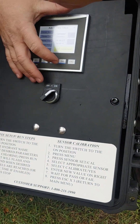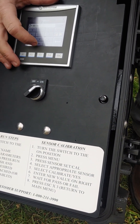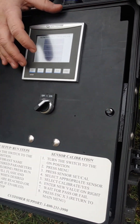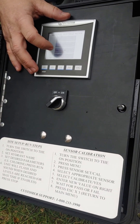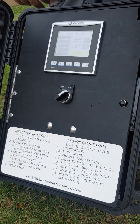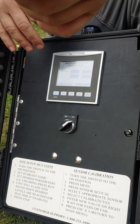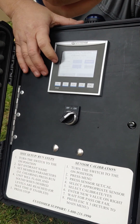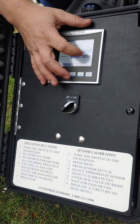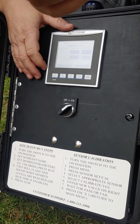It's set to five minutes right now. I want to see it run until it gets 0.2 — it ain't going to run that long, and we can trick it afterwards to simulate it. Time clock maintenance: today is the 6th, it is 2 o'clock. Adjust flushing parameters: if you ever wanted to flush on turbidity and chlorine, you can add a turbidity sensor and say you want to flush off that also. Right now I just have it flushing off the chlorine.